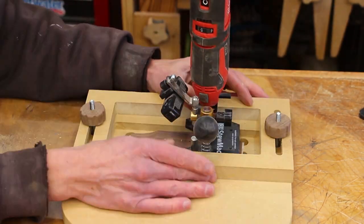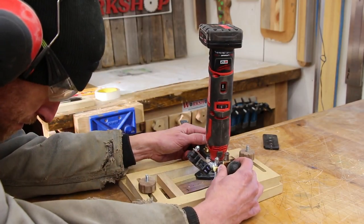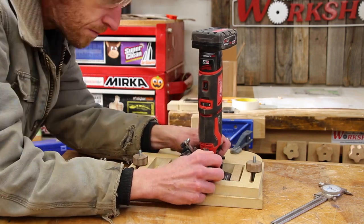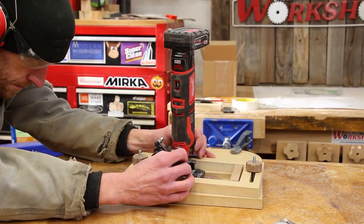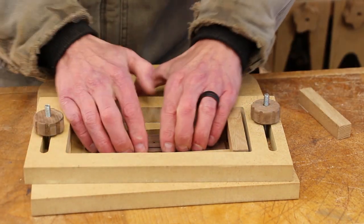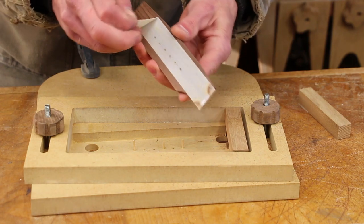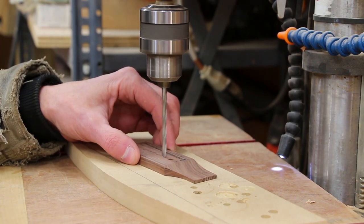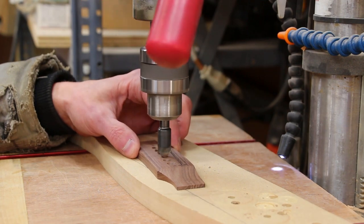I'll adjust the angle of the jig to match the lines that I've marked out on the bridge for the saddle slot. With everything set, I can now begin cutting the saddle slot. I'm making very small passes, taking my time — I don't want to risk going too deep. I'm going to stop several times and check my depth until I get to exactly a quarter of an inch. Once I'm there, I can remove the piece from the jig. Those little blocks are just some stops I stuck on there with double-sided tape to make sure I didn't cut too far in either direction. I may need to modify this jig a little bit to add some adjustable blocks. Now that I'm done with the toothpick dowels, I'm going to head back over to the drill press and drill out the bridge pins to 3/16ths of an inch, then follow that up by countersinking the tops of these holes.